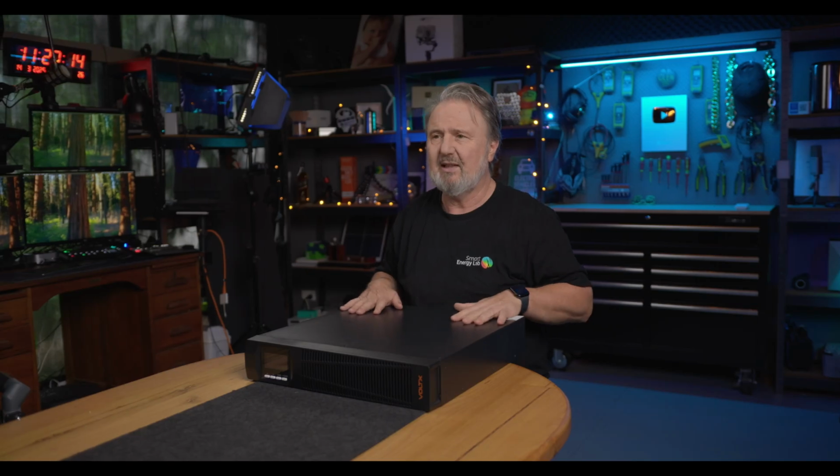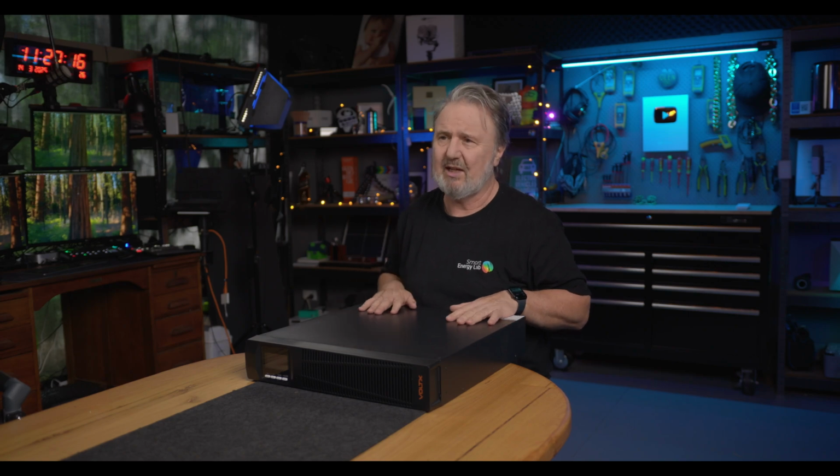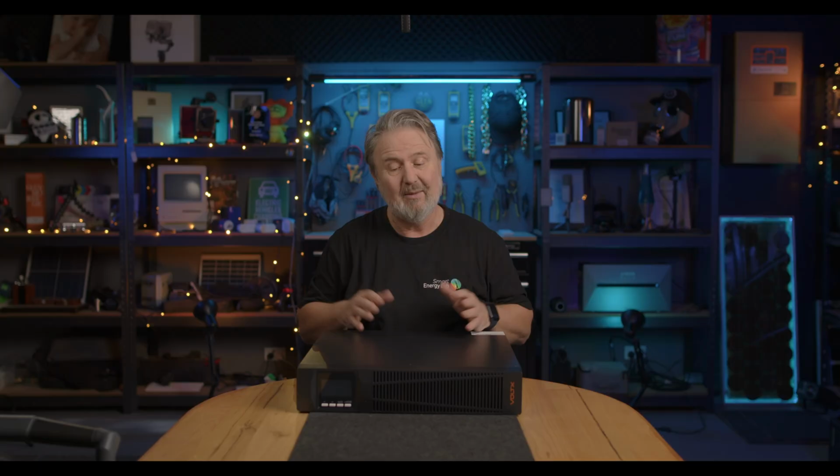They're also really heavy. And the other problem with lead acid is it has a relatively small discharge capability for reasonable lifetime. Whereas, you know, say a lead acid battery, you might discharge at 50%, maybe 60 or 70% occasionally. But a lithium battery like this has got a much deeper discharge capacity, typically more like 90%. So that's probably what I'm really excited about this. So this is a UPS with lithium batteries inside, and they're really low profile as well.